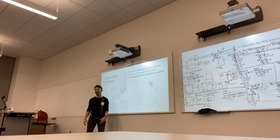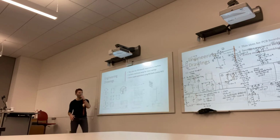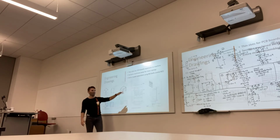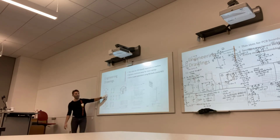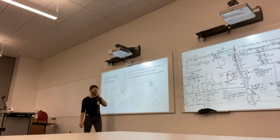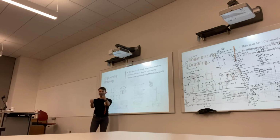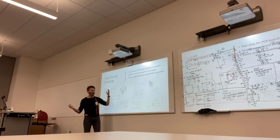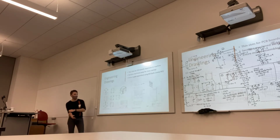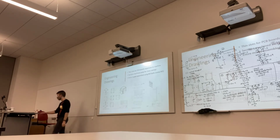So this was something, kind of a lesson learned, that we would suggest you steer clear of. You need to have a way to hold all of the electronic boards together. This is one way, but what we found, machining this ended up costing about $3,000 to $4,000. Most of it was because of these features here that we had to machine away. There's a much easier way to do it, which basically involves taking 4 threaded rods and putting standoffs in between, and literally all you have to do there is just drill holes. That's it. You don't have to worry about any of this stuff. We'll probably have a better example towards the end of the talk. But yeah, that was some of the engineering drawings we put together for that.